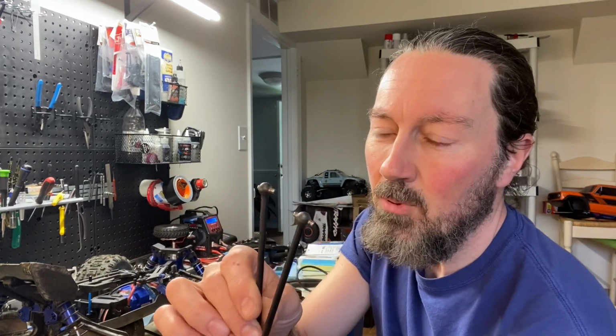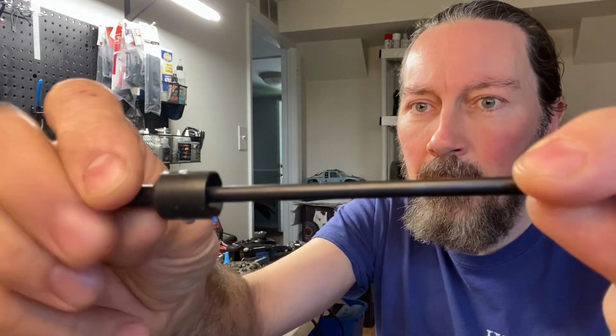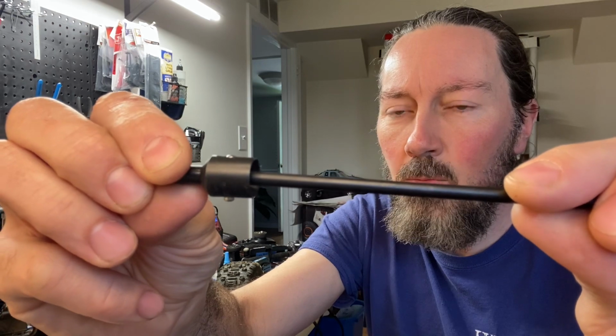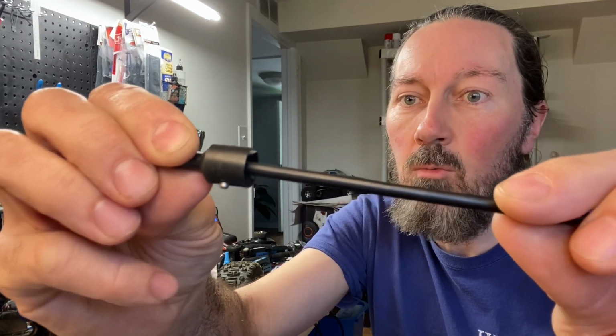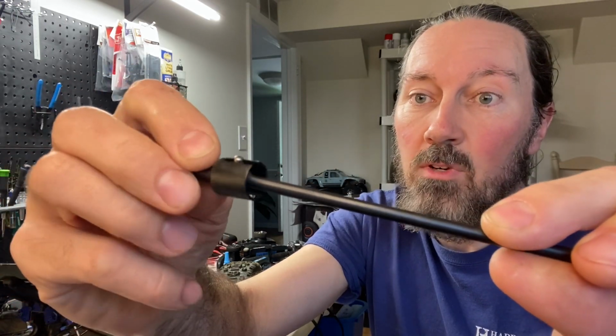It's something that I think you guys should pay attention to and just do a visual inspection. It's pretty easy to see when these are, I'll show you real quick. Here's an outdrive cup. These slide in, and if you look, you can see that it's sticking out one side more than the other, right? And it'll be even more pronounced the longer this goes on. Once these start to move, they're gonna continue going until they really stick out.